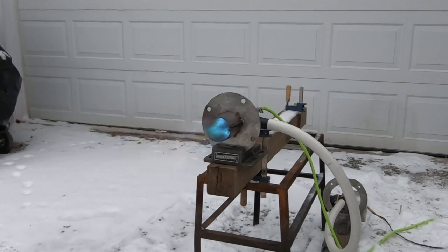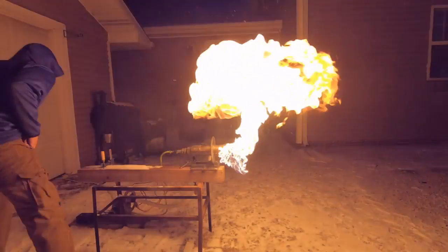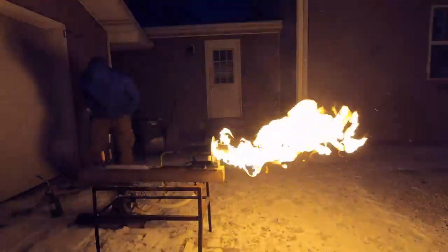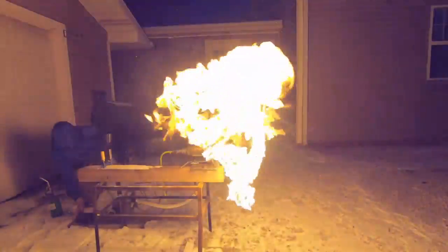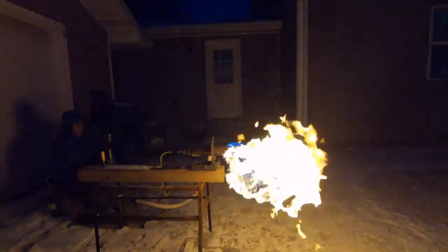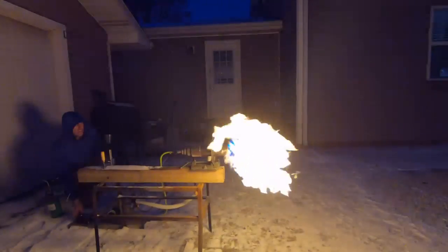So let's take a closer look at what we've got going on here. All right T-Dawg, let's go for a little walk. I'm just going to try to narrate what I'm seeing here. This is about 52 kilowatts of gas coming out of a propane bottle to simulate the waste gas coming off your guys' pyrolyzer. So what we're going to do is introduce a little bit of air.